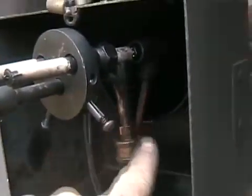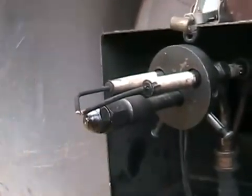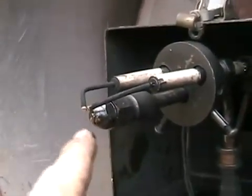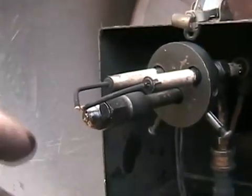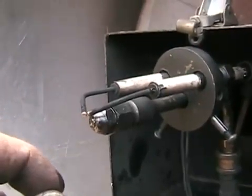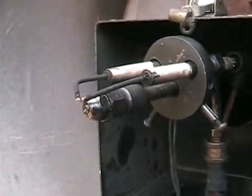It's got an itty bitty tiny hole with a feed line feeding it pressurized heating oil. It comes out in a cone-shaped mist like that. These injectors get dirty — there's a little screen behind there and the screen collects dirt, little tiny chunks of dirt or carbon build up there. Your little cone shape doesn't quite come out as a cone anymore. It comes out in a funny spray pattern, which can cause liquid fuel to end up in your combustion chamber and leak into the basement and possibly catch fire or burn really inefficiently.